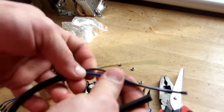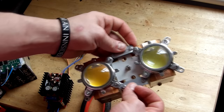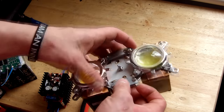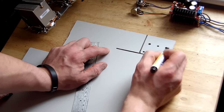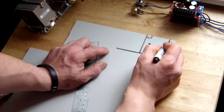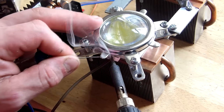After testing, we can start wiring everything up. For the wiring I am using this old AC cord from an old appliance. Before doing so we need to make a small panel piece which will sit between the LEDs for our switch and the two variable resistors. We can make the panel from an old sheet of metal, but in my case I will use this old sheet of wood I had lying around. Let's measure and cut it, then drill the three holes, and after that we can start the wiring.